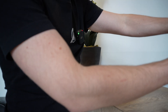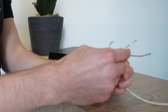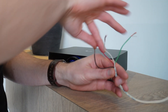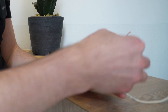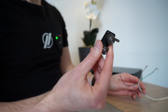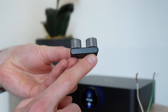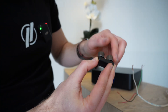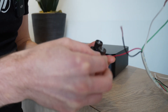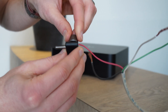For the speaker wiring routing, grab your wire. As shown in the diagram, we have two sets: red positive, black negative, white positive, green negative — our two channels. Take your banana plug adapters — they have red and black dots for positive and negative — and just unscrew them until you see the hole. Make sure the wire conductor is actually exposed all the way through.